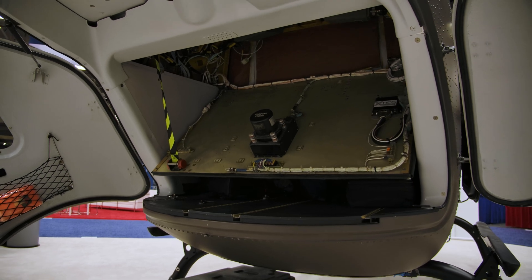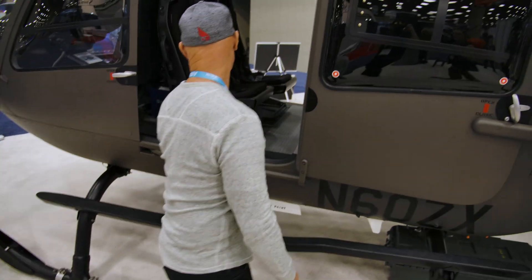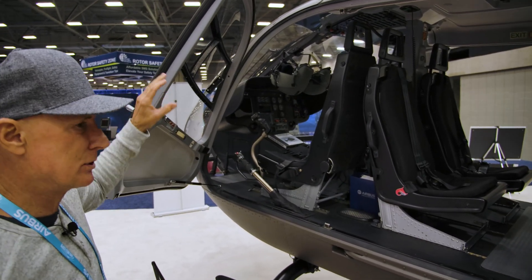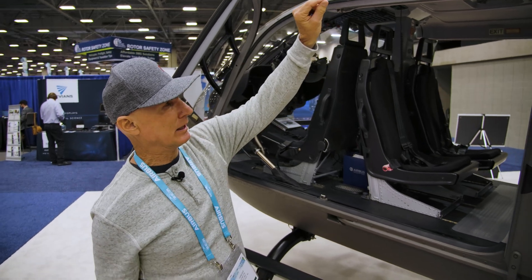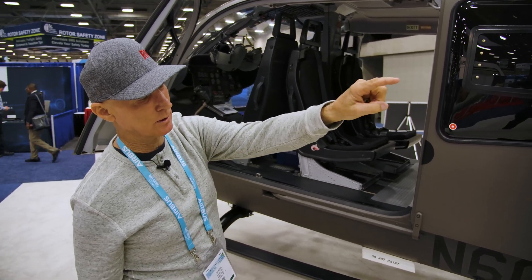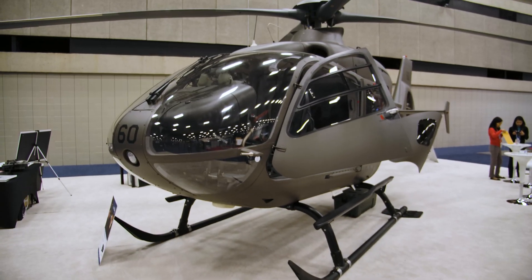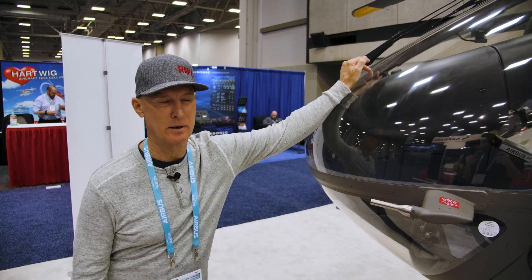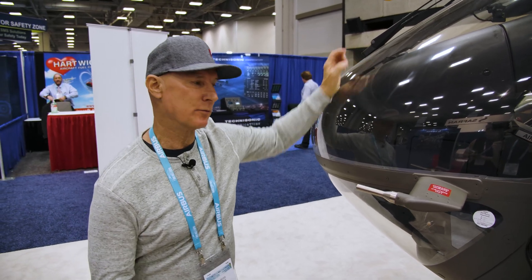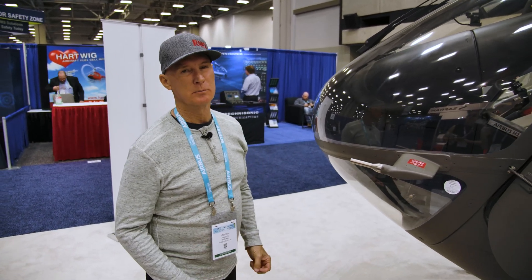We can come around the other side — it's the same thing on this side as the other side. Co-pilot up here. With the RMCI system, they have meters on the engine, the transmission, the shaft, the tail rotor, and the Fenestron fan, and we're downlinked by satellite with this device right here. This transmits all the way back to Huntsville, Alabama, and they can watch my tracking in flight no matter where I am and give me a warning if one of the bearings doesn't look good or something's out of balance, and can notify the crew before things go wrong.